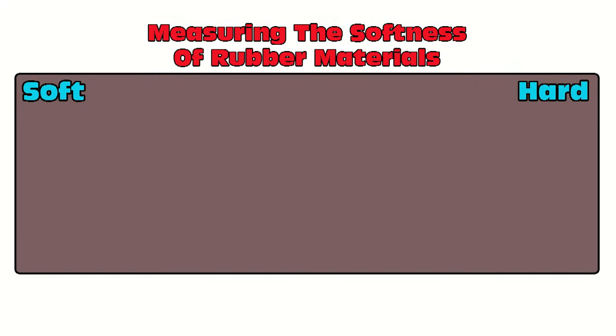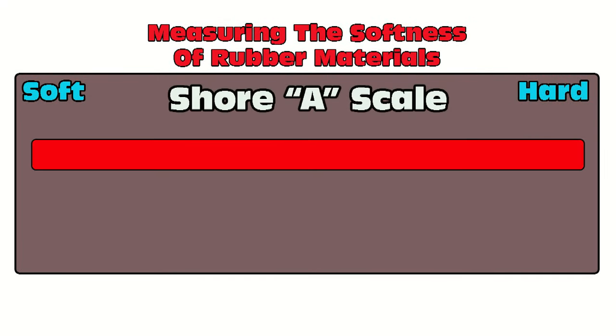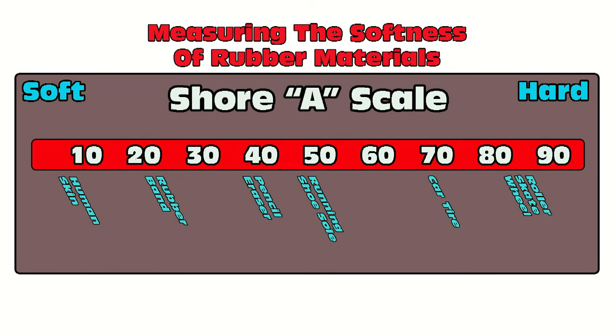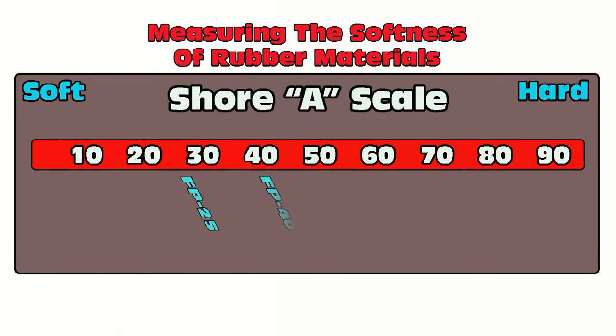The FP series is a line of polyurethane casting rubbers spanning a good portion of the Shore A scale. To refresh: low numbers are soft, high numbers are firm or hard. Shore A10 is a little firmer than average human skin; 80 to 90 is an industrial roller or roller skate wheel; 70 is like a car tire; 40 to 50 is a running shoe sole; 20 is a rubber band; 40 is a pencil eraser. Understanding that scale is important if you're trying to match material properties for product development or injection molding prototyping.